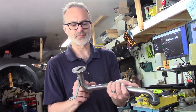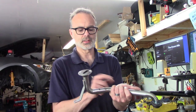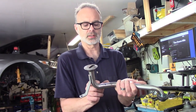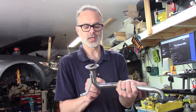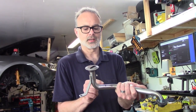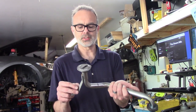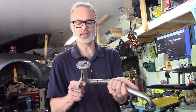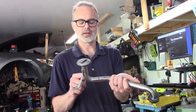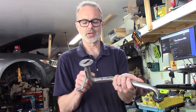And so you see a lot of aftermarket pickups where they basically sleeve it, right? They'll have a cut, and then to join it together, they put a bigger tube around it and then weld quite a distance away from the actual joint. And that's what I wanted to do, and that's what I intended to do. But in my first prototype, I showed, to get the angles right, I cut it mid-angle here, and then my overlap tube kind of, I broke my own rule.